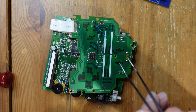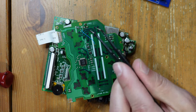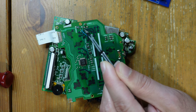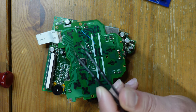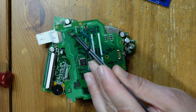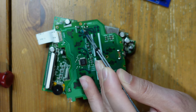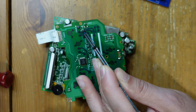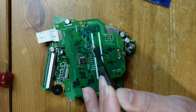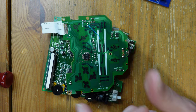I did end up having problems with the controller PCB itself — this is actually a fairly common problem with Turbo Express and PC Engine GT. There's a 47 microfarad capacitor on the other side, and these can leak pretty badly. There are traces right nearby and these corrode due to the capacitor leakage, so you might have one or more buttons not working or the turbo function not working. In this case, button number one was not working because of this capacitor leakage. There was a missing connection, so I installed a bodge wire between the two points and that restored everything.